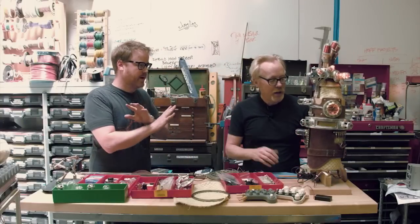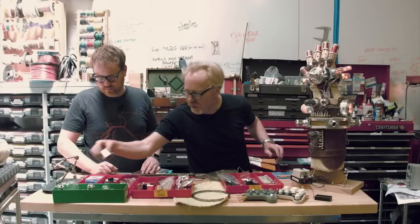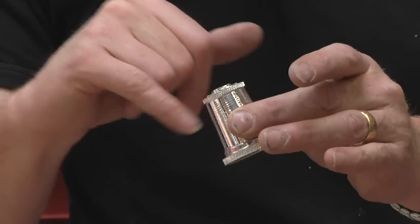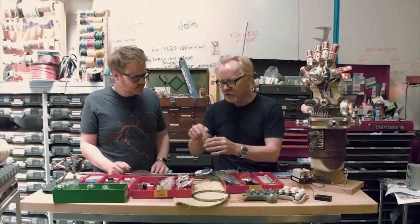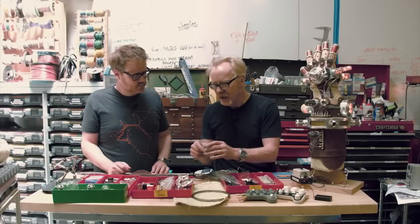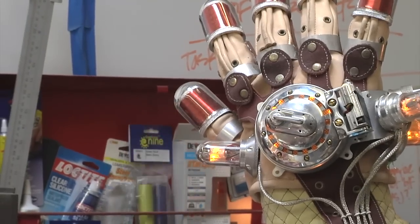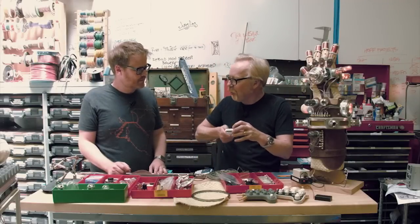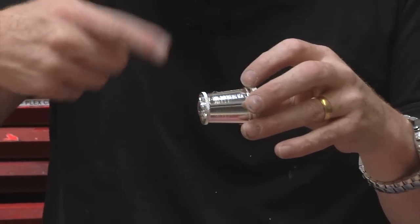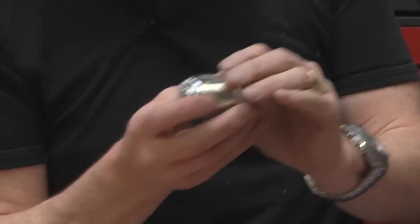The fingertips were another complex machining piece — there's lathing, then indexing. I had to make a holder to chuck it into my mill to do the machining around the outside and drill the six concentric holes. Then there's magnet wire — basically motor winding wire at point-oh-three-oh — and I had to wind ten fingers. I made a holder that chucked into the lathe as well, drilled the pilot hole, and sat there with the lathe on slow letting it wind up. Then I glued them in and put on the blown glass fingertips.